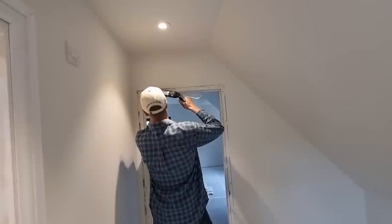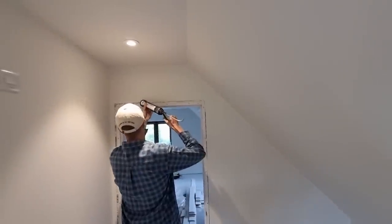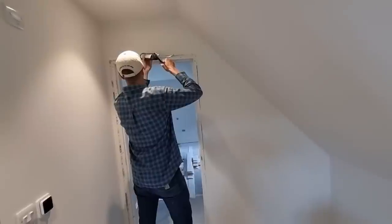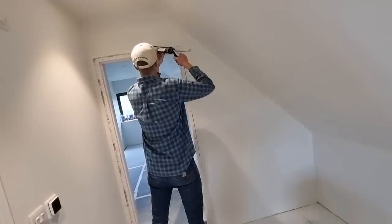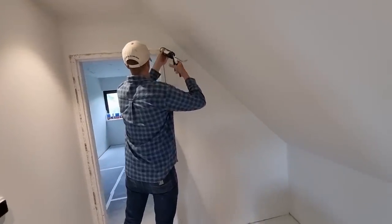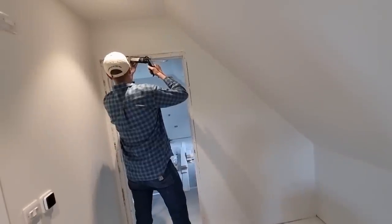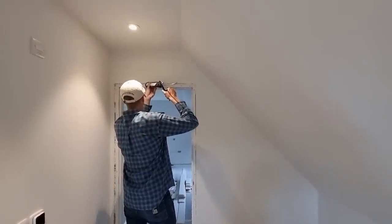I mean, the name of the game is to have enough there that grabs it, because the pins will always do the work as well. So it grabs it, basically. Yeah, you could do that. Go just on the plaster and just put a tiny tight line on the wood, for example, if you wanted to. Just a tiny tight one, almost flat. It's just to grip it, basically.